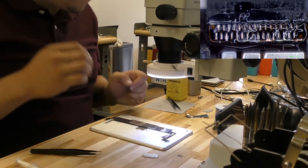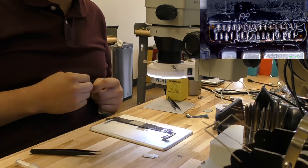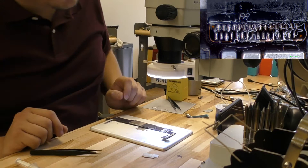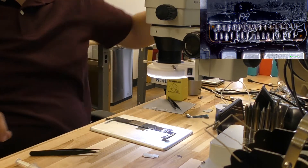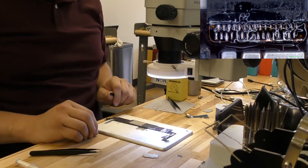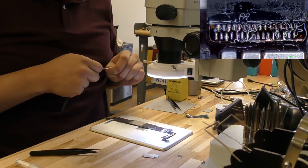So you might have seen me doing it a little differently — it's just the way I do it. Everyone does something a little bit differently. What I like to do is just get kind of like a blob and then just drag it around, make sure it's on every pad, and then go one by one. Make sure it's got enough on there and actually goes through and is applied to the board — to the pad on the board and not just the connector.